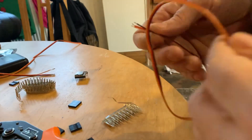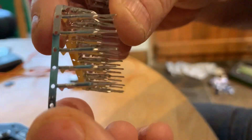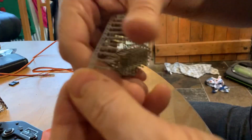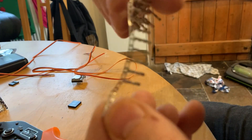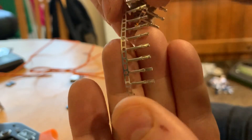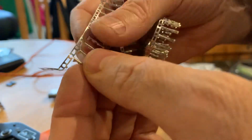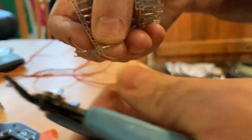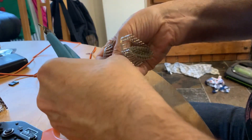The connectors we're going to use — there are two types you'll get in the pack. There's the male connector, which obviously has the big pin sticking out, and then there's the female connectors, which are used for pins. We're making a connector for a small soundboard, so I'm going to use the female connectors. The first thing I tend to do is grab these little snippers and cut off the ones you need — I'm just going to cut three off.